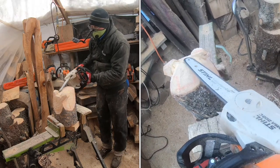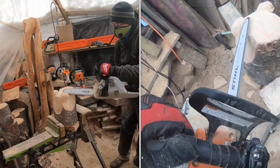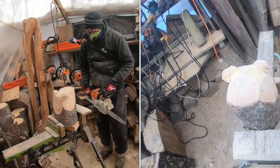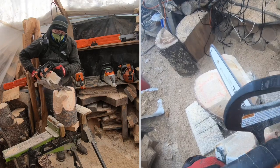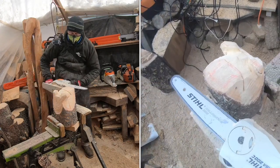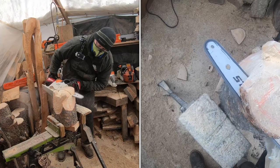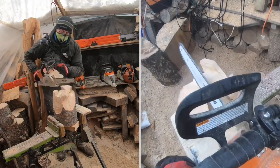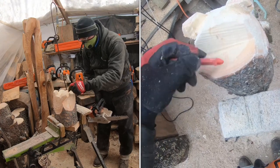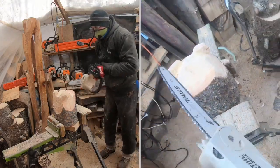Looking at the front side of the bear, cleaning up behind and between the ears. We want to make the top of the head rounded. Now we cut the forehead or front face in — I like to go almost full depth of the bar height, a little more than three-quarters. As we cut in for the nose it's thin and we angle it back so it's a bit deeper. We're trying not to overcut into where the eyes and face are going to be.